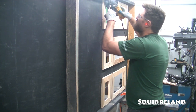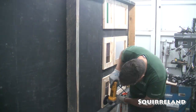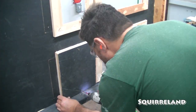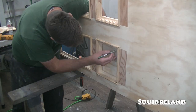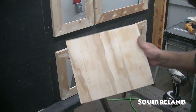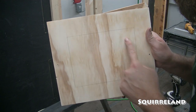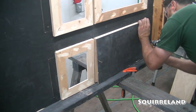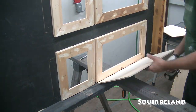Next, I need to use my angle grinder to grind down the finishing nails that are sticking through the back side of the trim boards. Now I can mark out on these pieces of plywood where the openings are in the middle of the attached trim boards. I need to know where the holes are in the rectangles in relation to the pieces of plywood so I can correctly place the next element of this design. As I go through and mark the corners of each rectangle onto the plywood, I make sure to number everything so I know where they go later on. The screws I'm using to temporarily hold them in place will eventually be used as registration markers for when they're permanently attached to the panel.